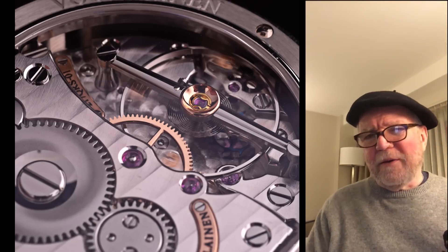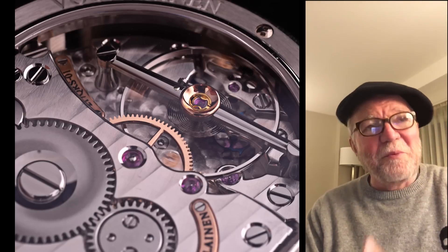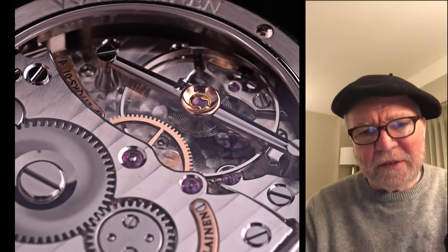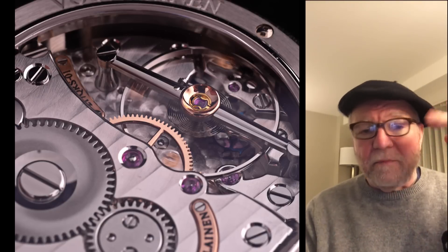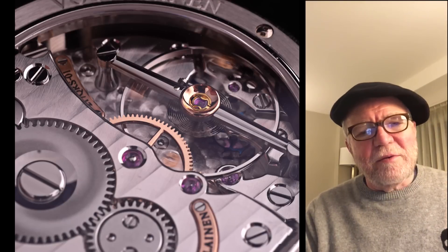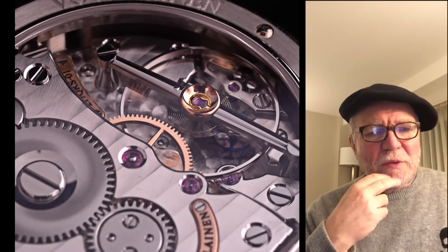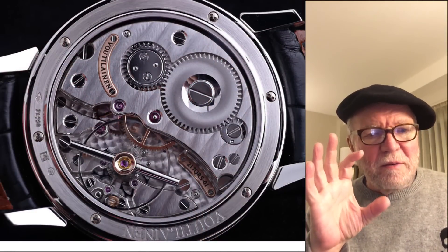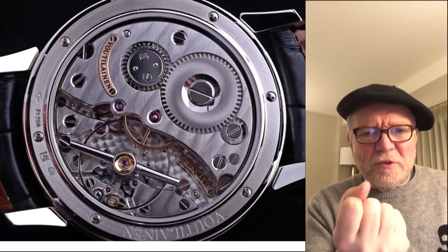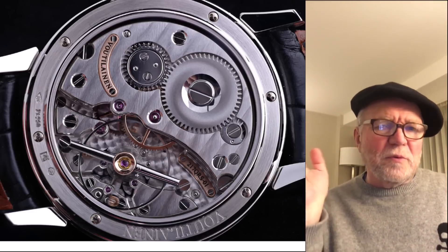The question has intrigued me — there are a lot of simple-minded answers and they didn't make any sense. Popularity doesn't mean excellence necessarily; it simply means something is popular. So the big question I have is: what's going on here? Looking at this particular Voutilainen, you can see at the bottom how big that balance wheel is. The bigger the balance wheel, the greater the inertia, which means the less influence from outside forces.